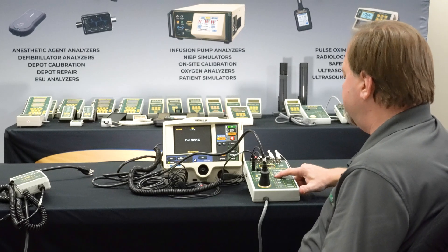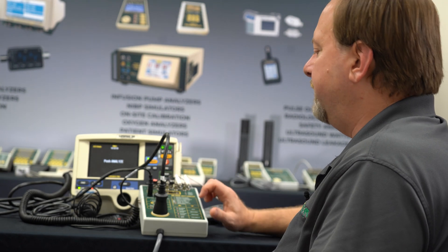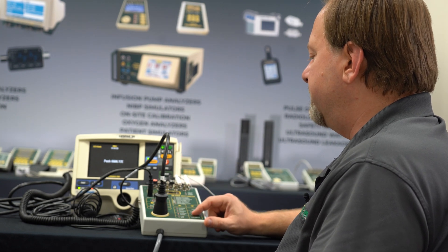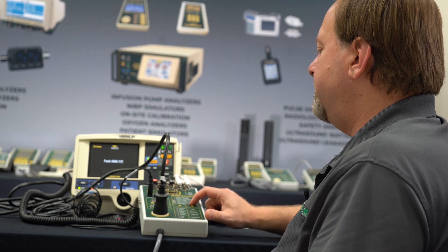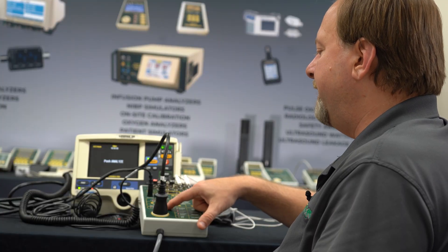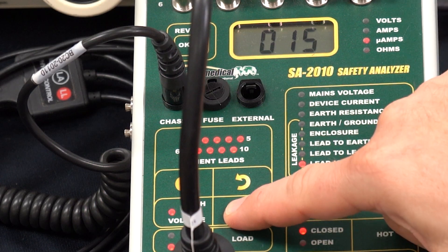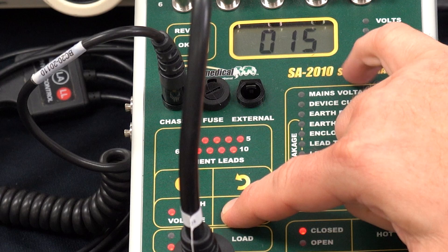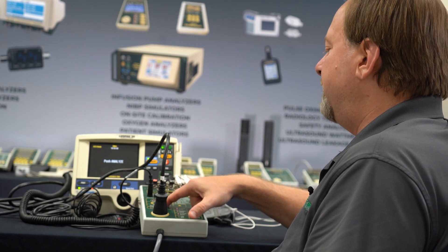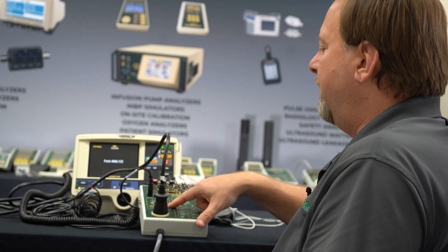We've completed enclosure testing and now move on to lead isolation testing. We apply line voltage to the test leads and measure the leakage current that results. Testing all leads at the same time makes the testing more streamlined. We go into lead isolation mode, select both forward and reverse polarity, and select the IEC load since we're doing IEC 62353 testing. We press the ISO test button — the blinking LED indicates high voltage is applied to those leads, so we don't touch them. We get a measurement of 15 microamps, which is under the limit. If any lead were over the limit we could disconnect them individually to find the problem.